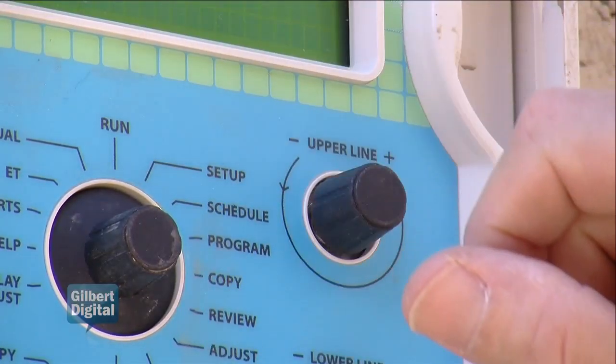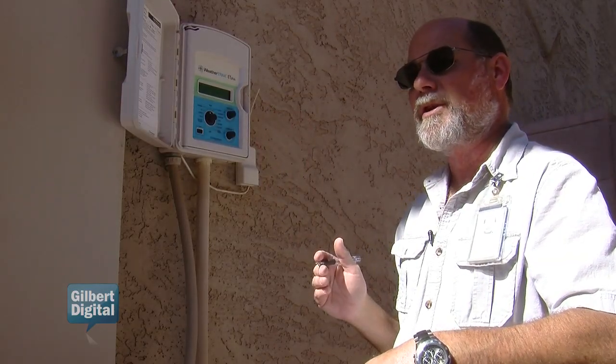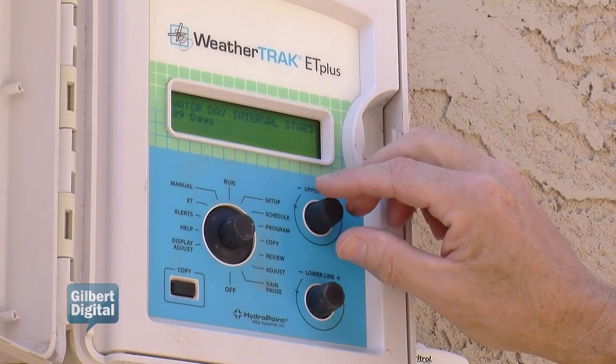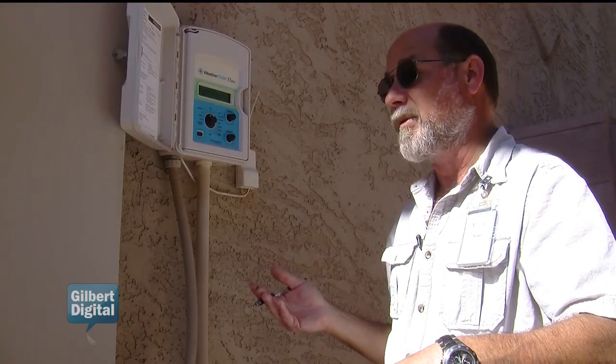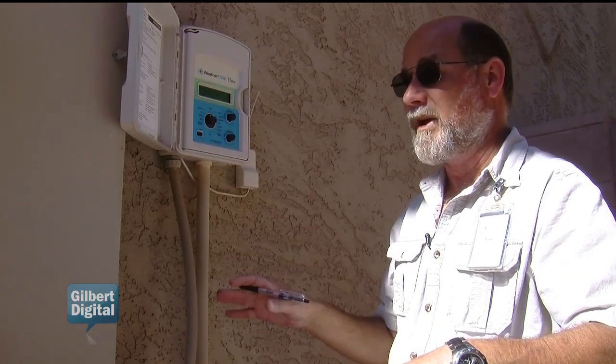This particular cycle time is set for 6 minutes. We're going to write down the settings of the irrigation controller to see how it's set up, and then we're going to turn on each individual station to see how much each station uses. This is important because on average 30 to 50 percent of a home's water use is actually happening outdoors, and if people are over-watering or they have some leaks in their irrigation, then that can be even more.